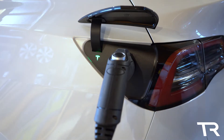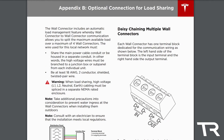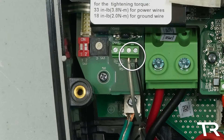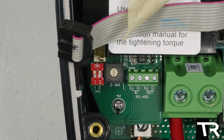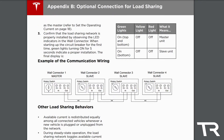One last thing I wanted to test is load sharing, which is a great option when you have more than one electric car to charge on a regular basis. Essentially, the wall connectors communicate with each other over wires and negotiate how much charge each car can have based on the total capacity of the circuit. On the primary unit, the dial is set to position 8, which is 40 amps, indicating that it and any networked wall connectors will never draw more than 40 amps in total, whether operating solo or with multiple units charging simultaneously.